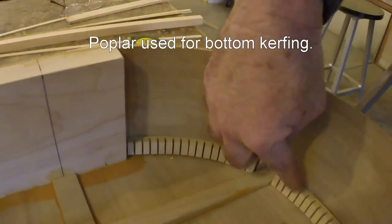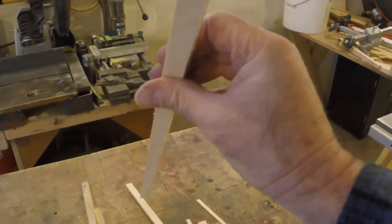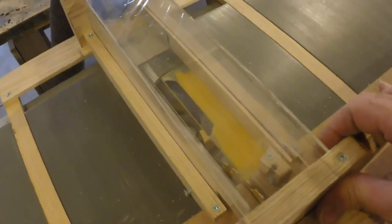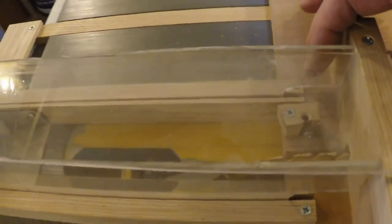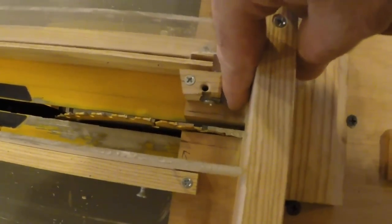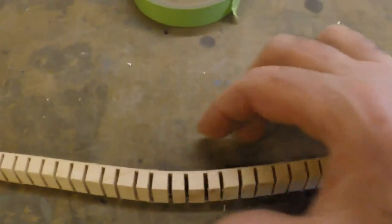Now I'm just putting in some little pieces of kerfing, just going to fit them around these braces. I'm making them out of these sticks — big and fat, about a half inch on the side and about a 15-degree angle. That's roughly what's going on. Here's my kerfing cutter — I can drop back behind the blade, push into the blade, and I've got a little piece of metal that basically keys my cuts. Here's a piece of spruce — you can see I bent it hard here and actually cracked that web just a little bit, which I really don't mind. You can see it's pretty floppy. I'll do this around the top, so this is going to be a pretty stout guitar. Maybe too stout, but at this point I'm okay with it.